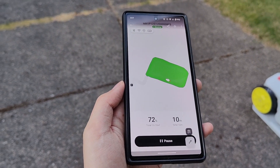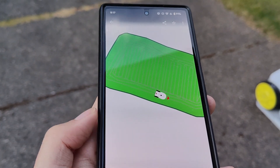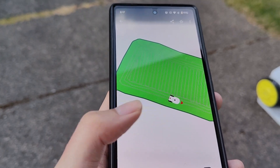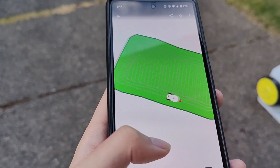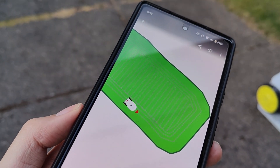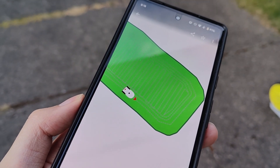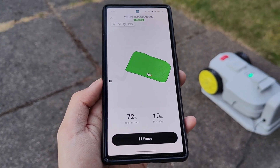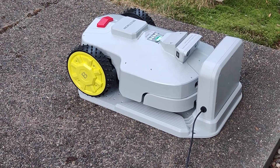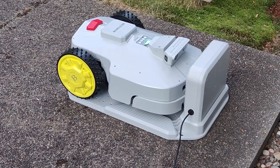As you can see in the demo, it's actually doing a pretty good job. The algorithm goes over the map in a horizontal way, mowing in a diagonal pattern, then going into a circle that gets smaller and smaller. So it's using both the X and Y axes as part of its route planning. You can see the live visualization of how much work it's been doing, as well as the amount remaining. The accuracy is also not bad when it comes to mapping and edge detection, as long as you have good antenna reception for the GPS unit.